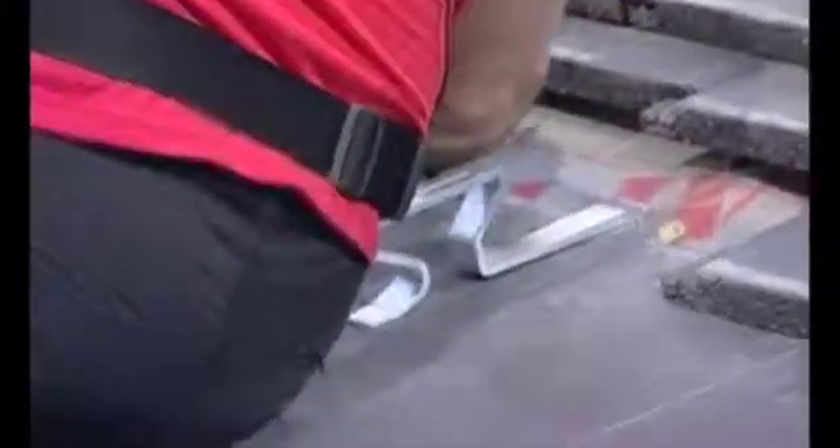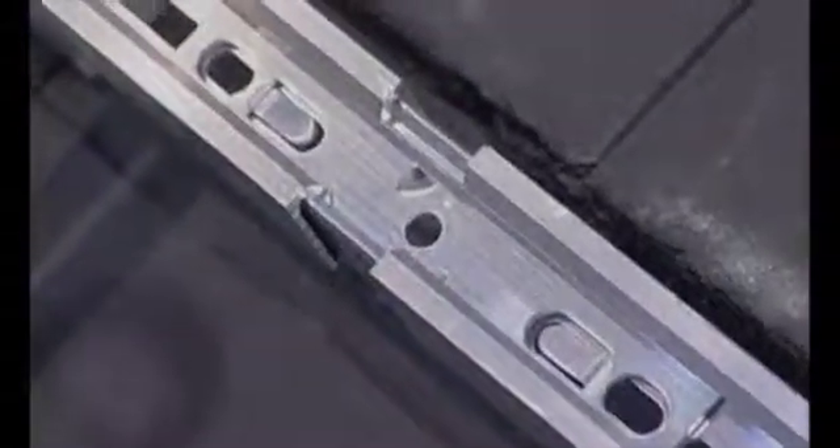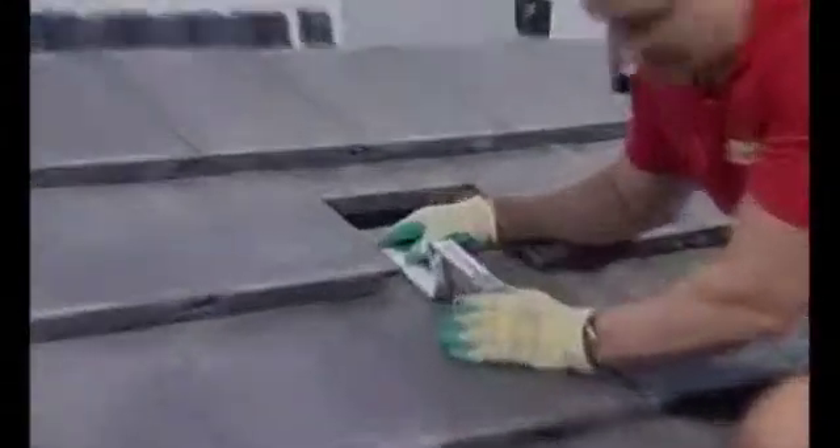As Chris puts the top brackets into place, Phil highlights two key improvements. First, the slot that the rails screw into is a longer length, giving more room for movement and meaning you don't have to be quite as precise with measurements. Second, the rails now clip together without the use of any tools — you simply push the central forming guide in and it locks in place. It's recommended to do as much assembly as possible at ground level. The bracket can also be unscrewed, flipped so it faces up the roof, and screwed directly into the rafters through the provided holes.